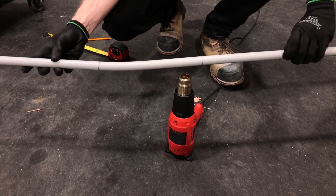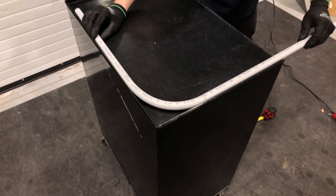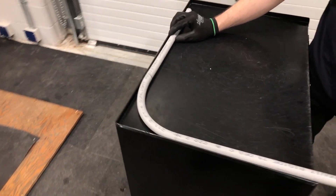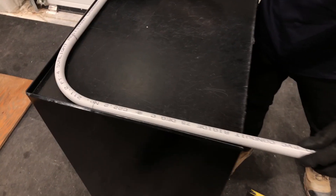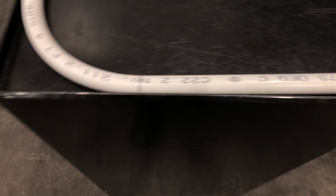As it gets really wobbly, I'm going to quickly bring it up and place it into my 90-degree frame. It's really handy to have a frame because it really helps maintain that perfect bend. I'm actually holding this pipe just a little bit over 90 degrees, maybe around 93 degrees — there's just a little bit of space between my frame and the outside back-to-back spots — because this pipe tends to open up a little bit as it cools off. I'm going to hold that for about a minute. You can use a wet rag to cool it down faster, or just be patient and hold it in your frame.